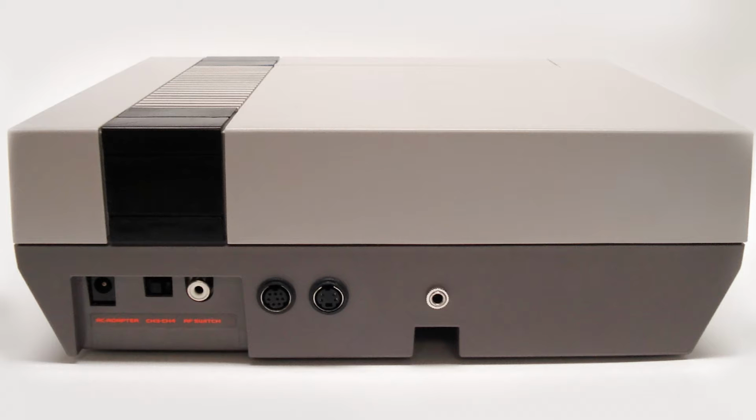Whoever did this installation did a beautiful job, but I'm a minimalist and I didn't want 3 holes in the back of my NES when I could, in theory, have 1. Tim's rationale for splitting up the video and audio is a good one, born from a great deal of engineering design experience. It prevents the lines from interfering with one another and causing artifacts, particularly in the audio. But with cables that are properly shielded and properly grounded, we should be able to use a single connector.